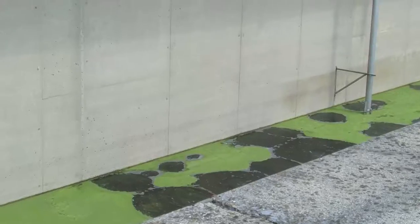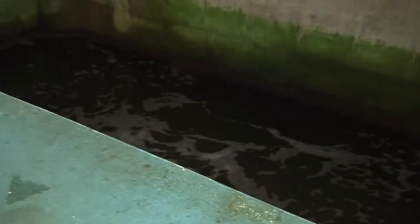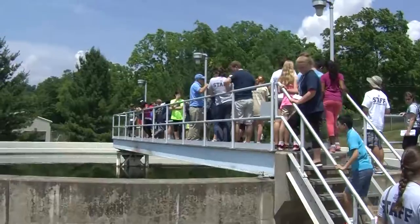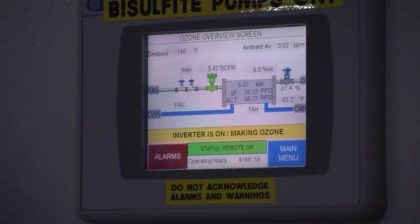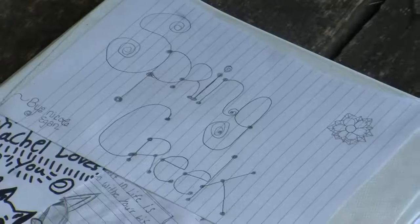We are a wastewater collection and treatment authority for the greater State College area. What you're here to see today is our advanced water treatment system. The original feed water is wastewater from your homes and businesses, and it goes through microfiltration — there are 90 units with thousands of straws each. Between the MF unit and the RO unit we have an ozone generator. Reverse osmosis quality water then goes through ultraviolet light for disinfection, and we add a little sodium hypochlorite. Spring Creek is a high-quality cold water fishery, so we have very strict limits on the water we discharge into the stream.